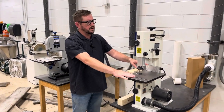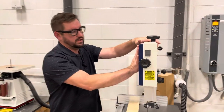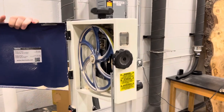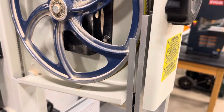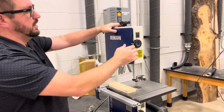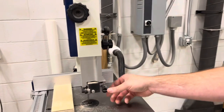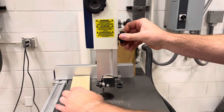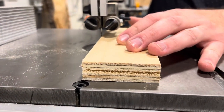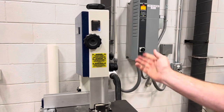This Rikon here is what I'm going to be showing you today. One of the parts I want to start with is the blade guard cover. If we open it up, the blade and the wheels are inside. This keeps you safe — just in case the blade breaks, it keeps it inside so you don't get hurt. Over here is the blade guard. You loosen this and it can go up and down. We always want our blade guard to be just about an eighth inch over the top of our stock. Then to lock it in place, tighten it nice and tight and we're set to go.